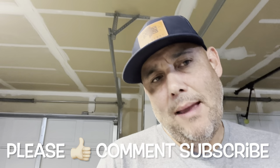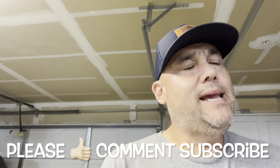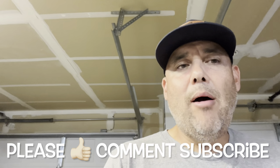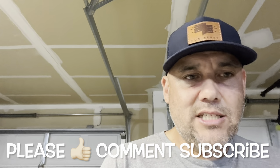So as I'm putting together this backlapping video and thinking about all the backlapping I've done in the past with different mowers, I've backlapped McLeans and California Trimmers and even True Cuts. And now I can add the Toro Greensmaster to that list. And it's because of the previous experience that I had, and this is the point I just want to stress, because I've worked on those other mowers, I kind of thought about it, the process is the same as it relates to each of those different manufacturers. And the only thing that's different from manufacturer to manufacturer is how you set the reel to bed knife. So meaning if you own a McLean, but now you want to maybe look at a California Trimmer and you're going to do a backlap on it, the process isn't that different once you understand how to set the reel to bed knife.